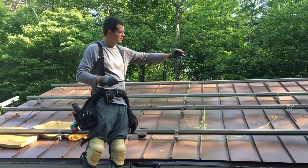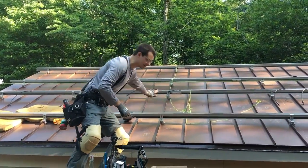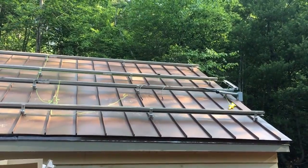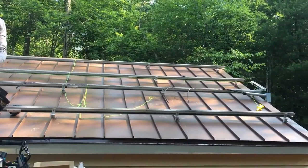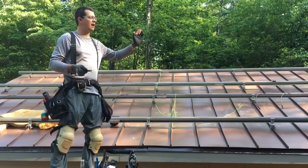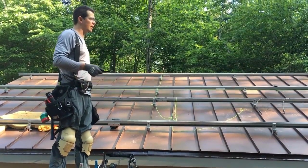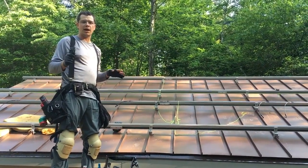I hope to show you some of it. I've leveled up each section of the rails and made sure that all the rails in this plane are level. That's going to give me a straight solar array. The other thing I've done is I've mounted, kind of like mounting batter boards, but I've mounted my string line on the edges of the array. So instead of trying to ballpark it or find something straight, I've made something straight on the roof. I know that this line is straight, and if I put the top edge of my panels up and get them starting to go, you don't have to mount all 32 panels to a string, but once you get straight, you can go.